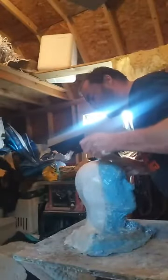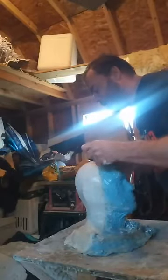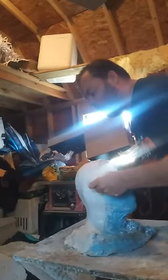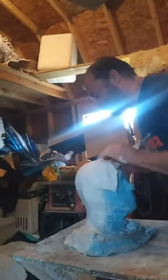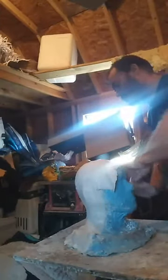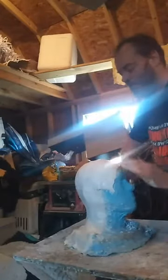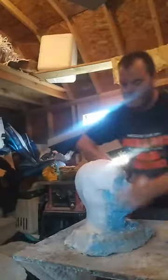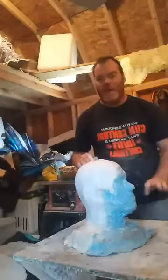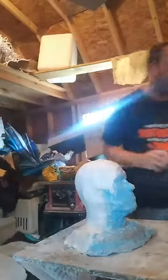They're not heavy-duty ones. All I do is I lay this where we put the Vaseline down. I just lay it right on top of it about halfway over. Then you've got a line that you'll see where you did your Vaseline. You lay this about halfway over. Don't lay it all the way over. Lay it halfway over on that Vaseline line. Reason being is if you lay it all the way over, it's going to lock on there and you'll never get it apart.